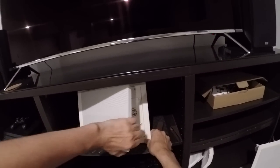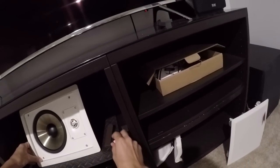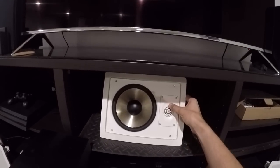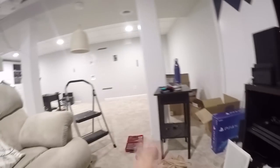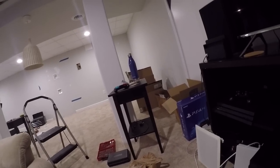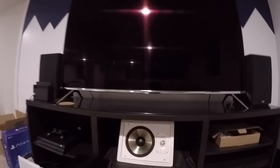Okay, so I'll take the grill out so you can see what we're working with here. These tweeters are directional — slightly. You can turn them left to right. So I was considering putting two of them on either side up there and then just tilting the tweeters out to the sides. The reason people say you shouldn't do that is because of something called comb filtering.